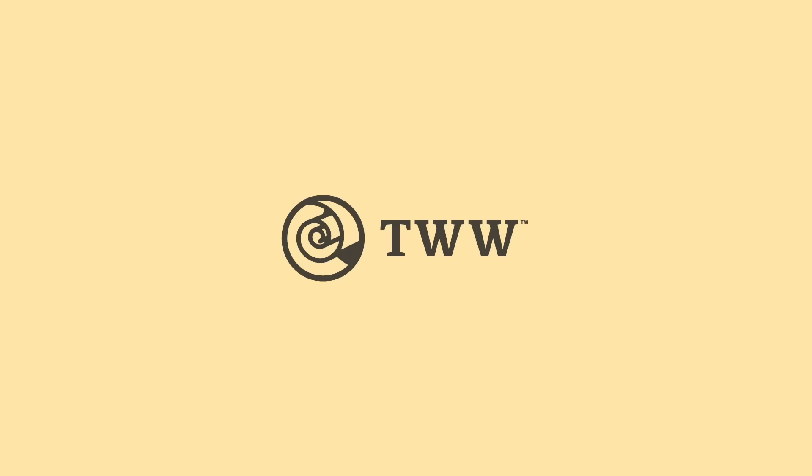With all these examples, what do they all have in common? They're all ways to fix problems. I really don't use CA glue to hold my joinery together — I use it as a creative problem solver for mistakes. If I only had to buy two viscosities, I'd probably get gel and medium. Gel and thick are very close in viscosity, so you don't need both. Thin is just a very special use case. A good spread is getting medium and gel.